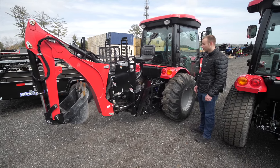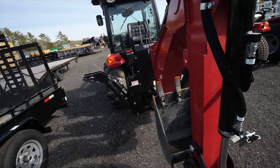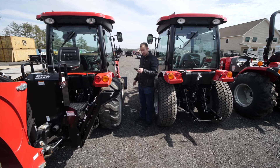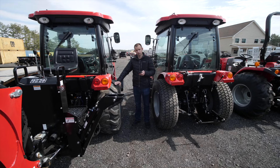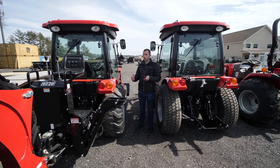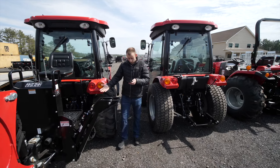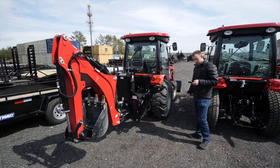Let's talk weight — a big consideration for heavy hydraulic-powered machinery. This tractor, just with the cab tractor frame and nothing else, weighs 3,607 pounds. Add the loader and that adds another 1,020 pounds. You also have the option to load your rear tires with a liquid ballast; we use a product called Rim Guard, which is actually beet juice — heavy, non-corrosive, and works really well to add stability. Loading the rear tires on this size tractor would add 836 pounds. Adding a backhoe adds another 1,400 pounds. So as you see with this unit right here, it weighs 6,863 pounds — that's a heavy tractor.